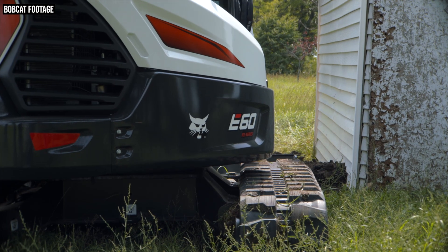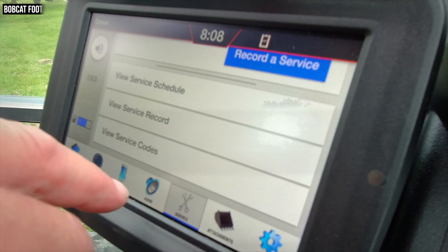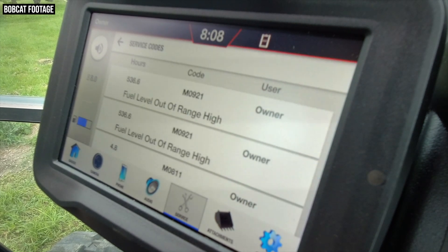The big improvement with the new engine is an upgraded fuel system. There's a bigger fuel filter with two times the surface media, so it's going to last longer. It's got a clear water bowl on it and a sensor, so it'll tell you in the cab if it needs service or if there's an issue. There's also a pre-filter now to protect the system better. It's also a self-priming system now with a lift pump, replacing the older-fashioned primer bulb.